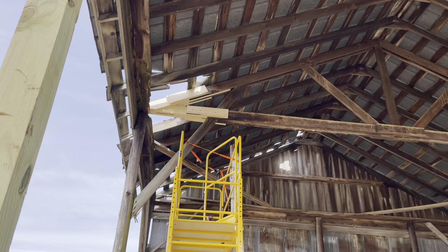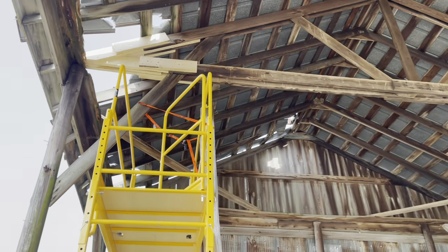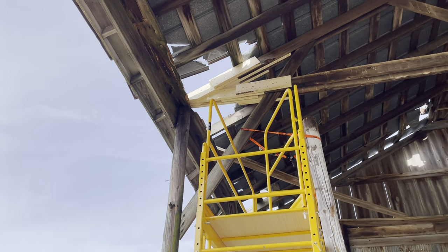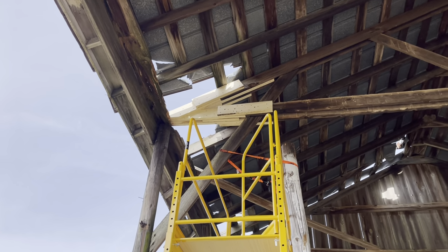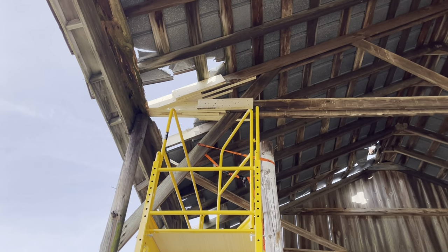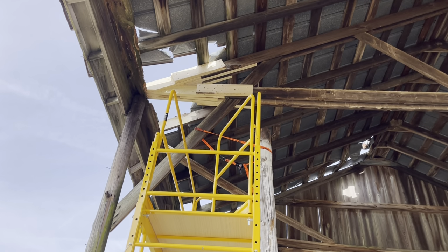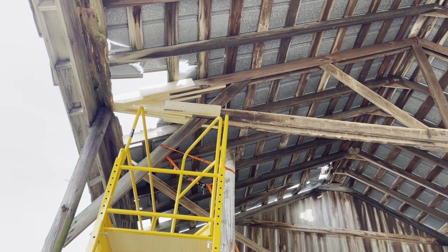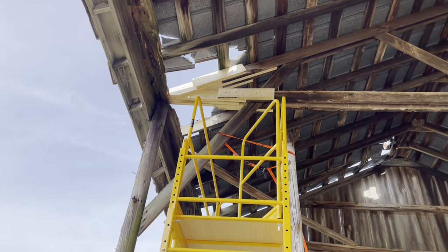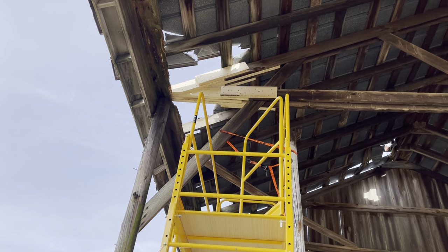There it is, all sistered in now. I've got the bottom stretcher done, and then I've got the rafter put in, and I've sistered them the best that I can. I'm gonna come back on a couple of these and throw some bolts all the way through so that I can use nuts on the other side to really pull them in tight, but I think that'll do the trick now. I'm pretty sure that this diagonal brace right here is the only thing holding that up,